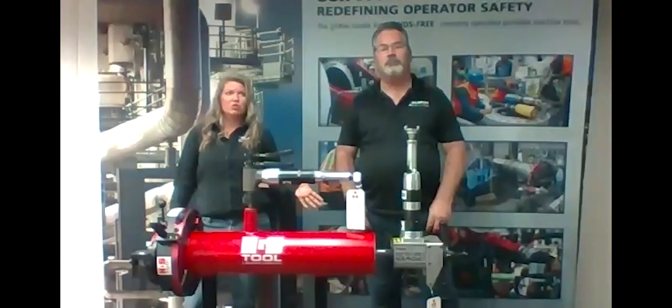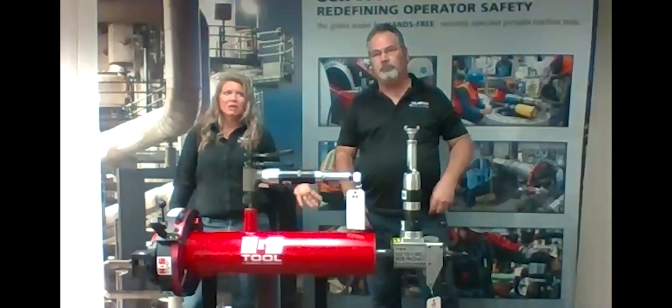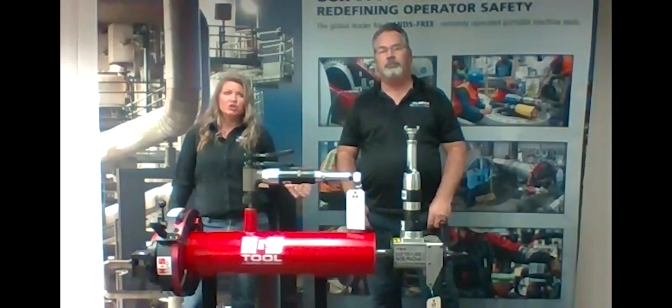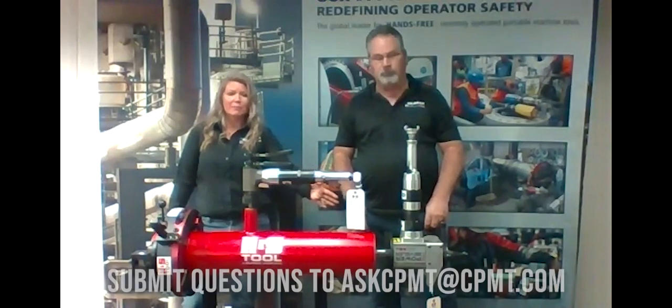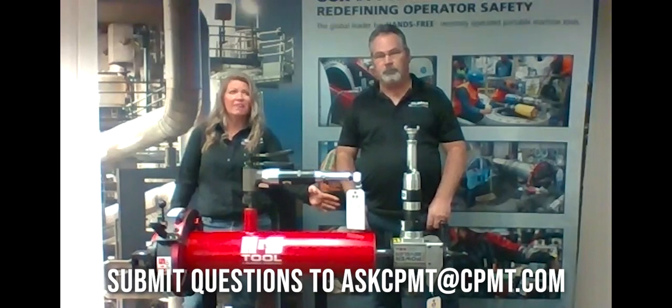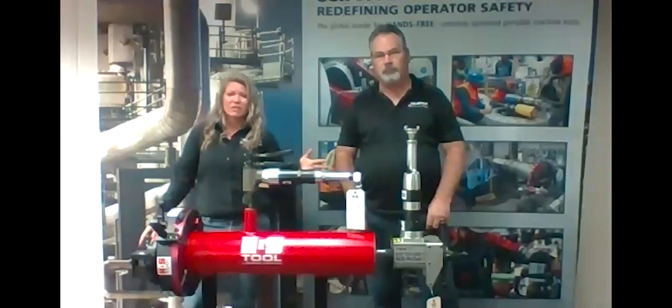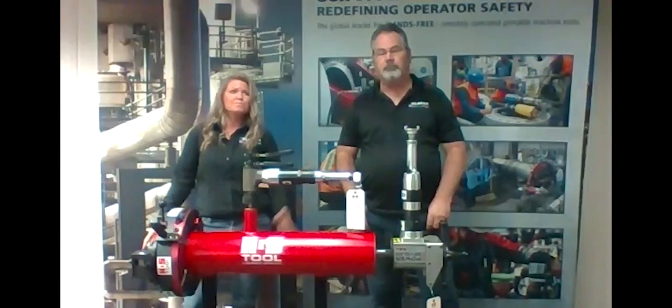We're actually going to show you how to time a blade as well in the video. And some of you might be thinking, well, timing a blade, what does that mean? Timing a blade means that your first blade, you're going to stop actually against the pipe or tube after doing a couple passes. So what this does is it lines up your blade on the actual pipe or tube so that your second one can be touching that pipe or tube as well. So you're gonna slide that in. So you'll see that in the video. And what that does is it helps you stabilize your cut. The second blade will help open up that and it'll give it more stabilization as it's cutting or beveling.